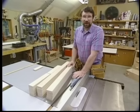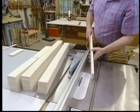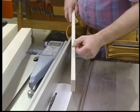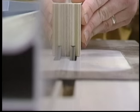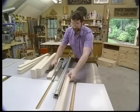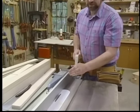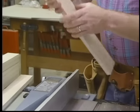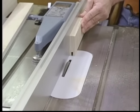Here are some of the plywood pieces I'm going to use to make the dust panels. I need to mill a quarter-inch groove centered on the edge of each piece, a half inch deep. I've set up my stacked dado head cutter with just the blades — no chipper — and that gives me the quarter inch that I need. Here's a tip: even though I've spent quite a bit of time setting up the dado to have the groove perfectly centered, if I rotate the piece so that the opposite face is against the fence, it'll guarantee that it's centered.